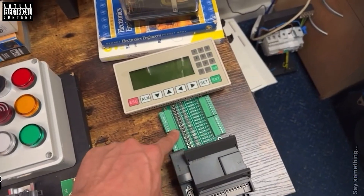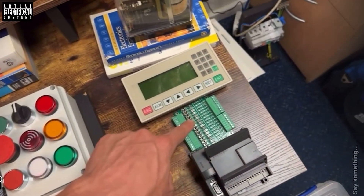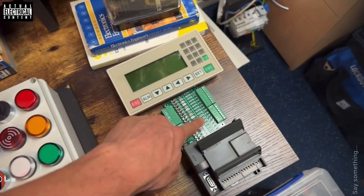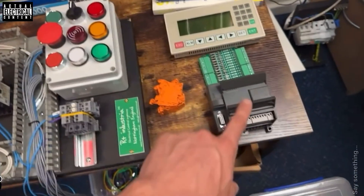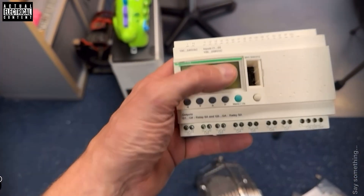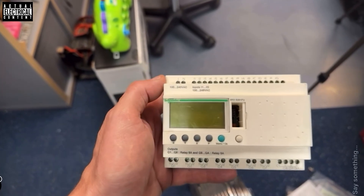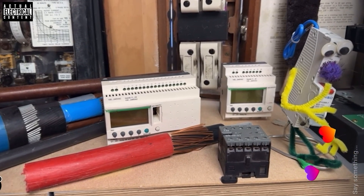The basic parts: the PLC, the IO test card and the HMI. I think that's what I want on my first rig - my PLC, my simulator and my HMI on the rig, working and talking to each other. Then everything else I can incorporate as needed, but it will be a standalone system ready to go. I can also just as easily swap this PLC out for something like that one there - a smart relay like this to do this job. I'd quite like to build one of these smart relays into one of those as well, unfortunately I've got these in 24 volts so I can't do that at the minute.